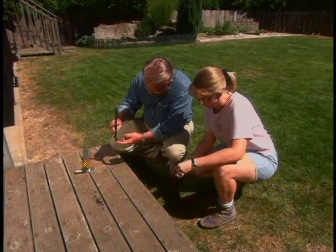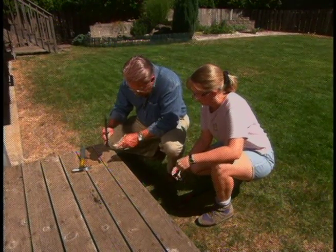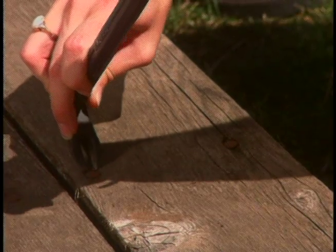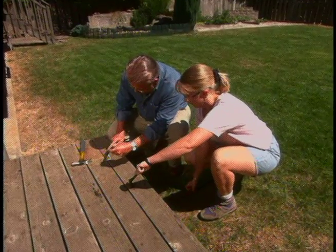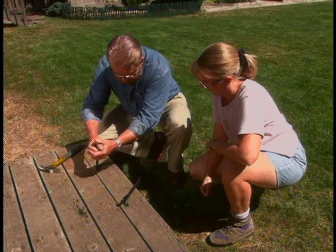This is a nail puller. You haven't? No. It's actually a Japanese hand tool. It's really great. Here's the way you use it. Put the tips of this tool right here, those two sharp points, right at the edge of the nail head, like that. Okay, then take your hammer. There's a striking surface right here. And the idea is to drive this up underneath the head of the nail. All right? Now, we're going to pull this back like this.